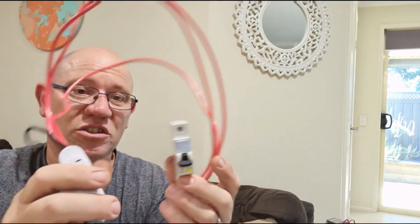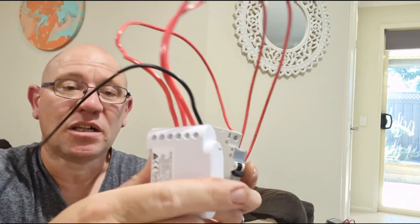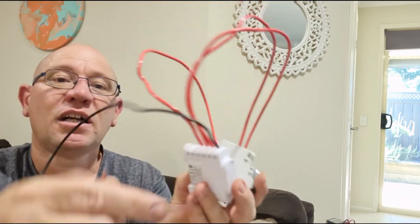Here's my final setup: this is a 10 amp fuse — overrated for this job but it'll do. All your wires are hooked in; if you've got a three-phase system, I'm going to use my third phase to monitor the shed. There's your neutral in the front, and your coils go into the back — A into A, B into B, and so on. Just clamp them around the wires. The maximum this can take is 120 amps at 230 volts AC, and the load relay connection maximum is 10 amps.